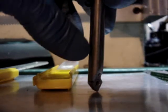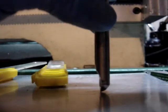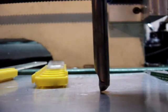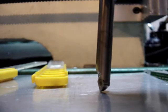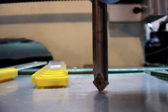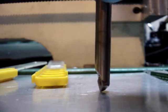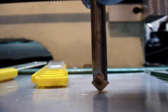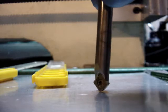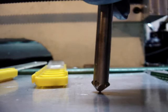And let me tell you, it works awesome. Just awesome. It's kind of a thick insert — I think it's an eighth of an inch thick. So the smallest hole I've been able to do is about 0.19 of an inch. But that's a drilled hole. Chamfer mills are usually meant for profiles and stuff like that, and I've been using it a lot for that. And it works just dandy. It's really cool.